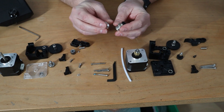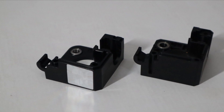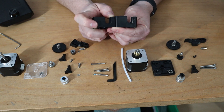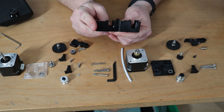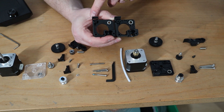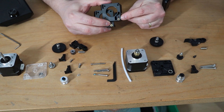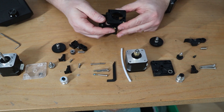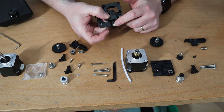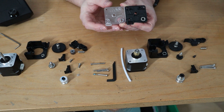The plastic brackets look almost the same at first glance, but there are differences: the clone's bracket is a little smaller and not as tall. For the nut housing on the back, the clone's section is shorter while the E3D version is longer. The clone presses the nut in, whereas E3D screws it in — another sign of higher quality in the original.